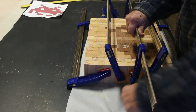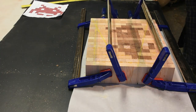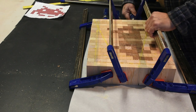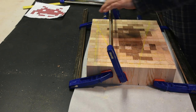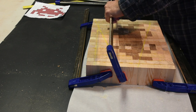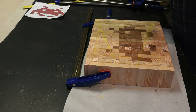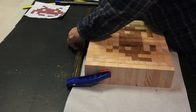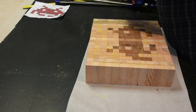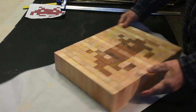Here's our gluing table. I like laying it on parchment so if it glues down, the parchment is easy to get off — or wax paper. Avoid newspaper; it's a lot harder to get off and it'll stain your product. Parchment is pretty cheap. I just took one side at a time and wasn't moving them around too much. While waiting for the glue I was cutting all the pieces for another board — when you have the setup here, it's just as easy to do two or three as it is one.